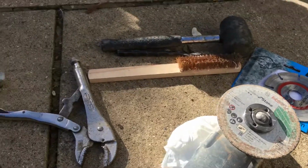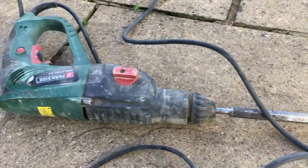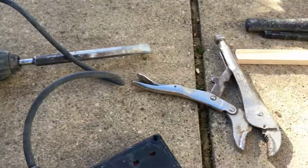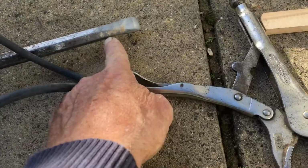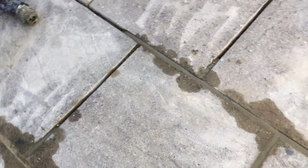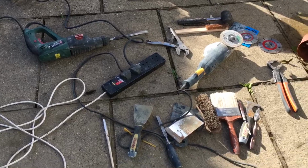And then also, I want to sharpen my SDS drill bit. Now, just talking about that thing right there, there's a lot of loose mortar in here, and it's easy to go crazy with this thing. But what happens is you're going to end up damaging the bricks, the sides. If it goes down into that shoulder, it's going to pop it off. And I did it on one over here somewhere. I popped one corner, and I said, oh. So I got to be real careful using that thing. If it's a really, really good job, then I don't know if I'd recommend that at all. Hand chiseling maybe would be the main thing.